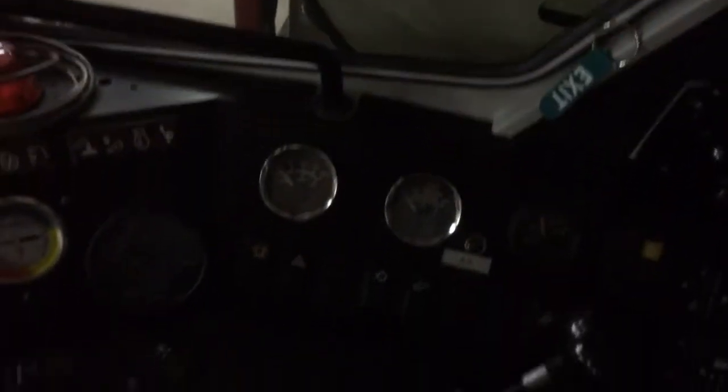There is a chart on the side of the window that will show you speeds that you should be running at. For corn, you're going to need to set the concave clearance, and that's this turn handle on the right side of the seat. And here's the dial adjustment. If I turn this clockwise, it's going up. Corn setting is from 21 to 27. Not sure how small those ears are, you might start around 20, 21, 22, somewhere in there.